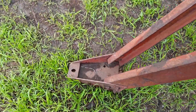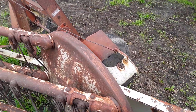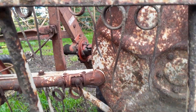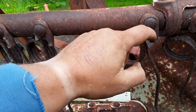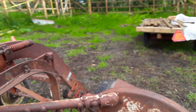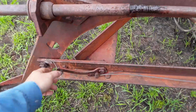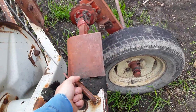The hitch is definitely more heavy duty, and the bearing cups right here are fairly heavy duty. It's still got the original teeth on it — I actually just picked this up not long ago. Somebody started to change them to New Holland right here, but they bent this one for whatever reason, and they've got a different holder on them, so there's some difference. There's a bearing that has to be done right here; there's some major slop in it. When it moves around, the bearing actually comes out — probably got cut up by the twine that's on the shaft here. To disengage and engage, there's a lever with a cable that pulls the pin on the gearbox that takes it in and out of gear.